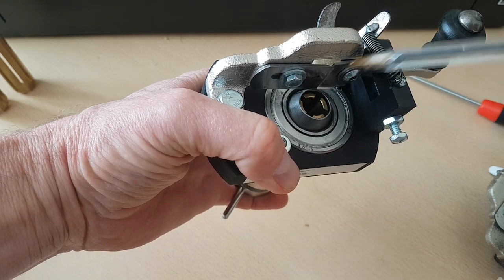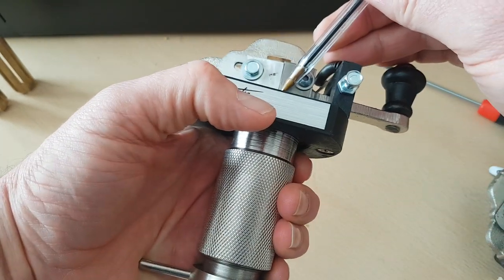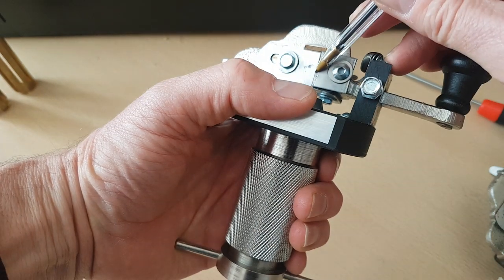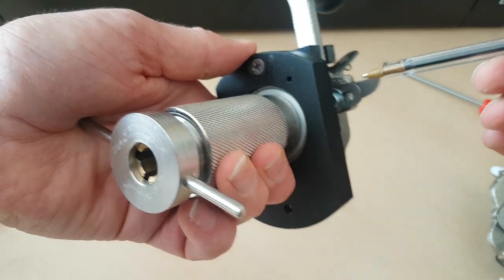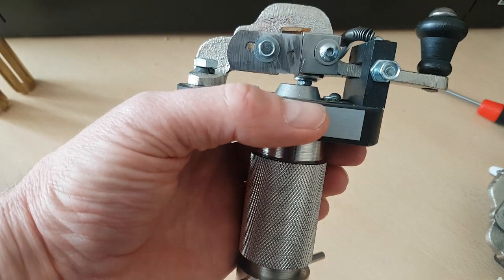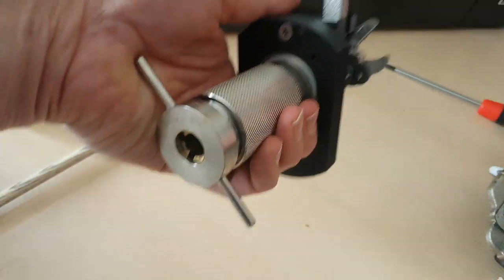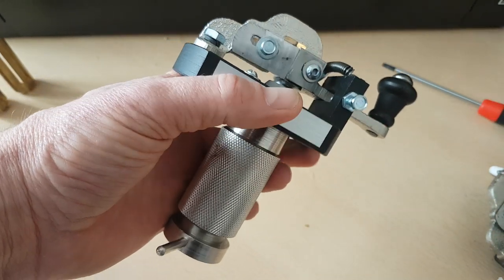You can just about see where the collet comes through at the top end. You carefully slide the cue in, get it to the right height, and there's your cutting edge at the bottom. You've got a base blade there — that's the main cutting part of the tenon blade — and then what they call the mouth at the end, which you adjust. At the bottom you've got another cutting blade. You can adjust the cutting edge with one screw, this one for the mouth gap, and underneath a bolt to adjust the depth of the bottom blade.